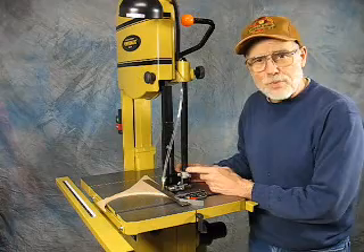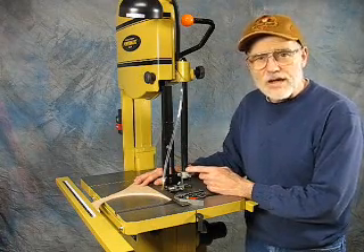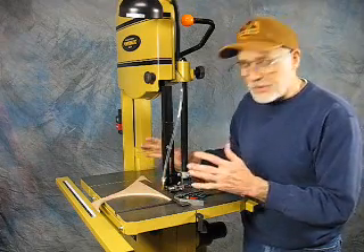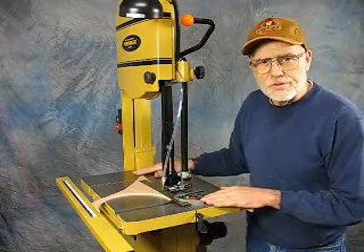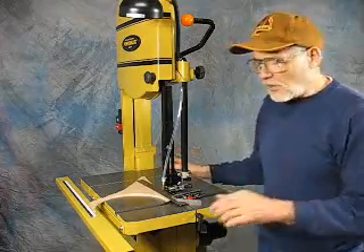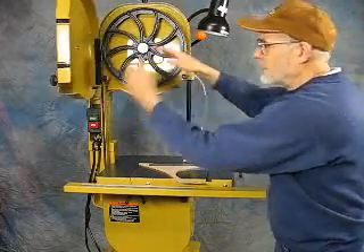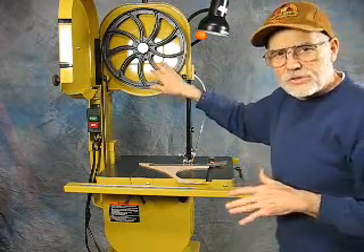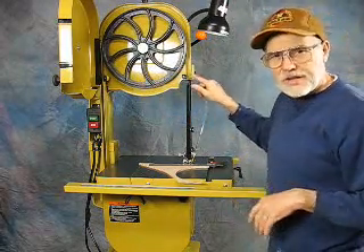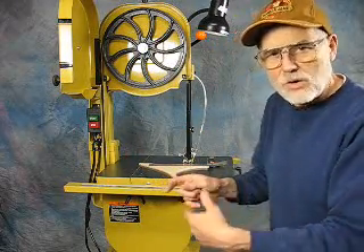I just wish they would have had a flat spot in there, or some explanation in the plans of how to figure it out. But now it's figured out and it's all done. When I started out with the table and everything off, I had a five-foot straight edge on the wheels — the wheels before I started were tracking perfectly. The blades I had in there tracked evenly top and bottom; there was no closer on one edge or farther back on the other side. It tracked true all the way around on both wheels.